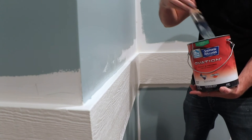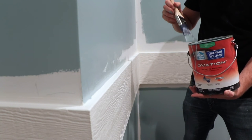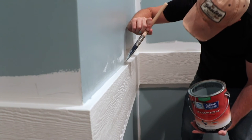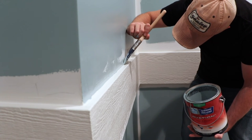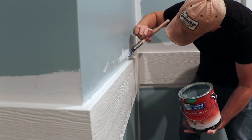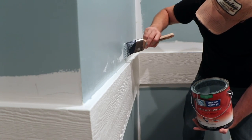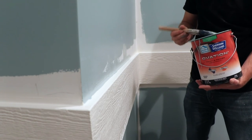I'm still working my bristles into shape here. If you have a good cut-in brush, you'll notice it's getting finer and finer the more I paint. The bristles are slowly getting themselves worked into position unless I clean this brush. The more I do that, the more in position those bristles get, and the easier it becomes to actually cut it in.